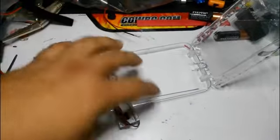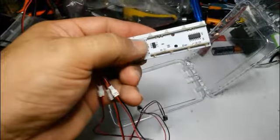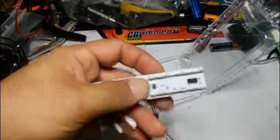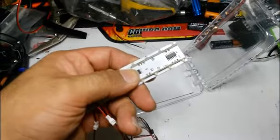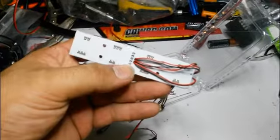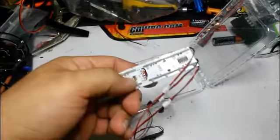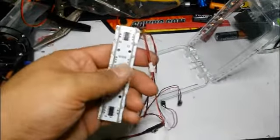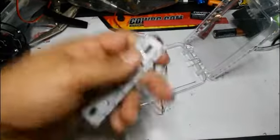You don't eventually end up breaking the soldering points, which aren't secured by anything — they're not secured. Some people will put a blob of some kind of sealant on there, not only for waterproofing but to keep those in place when you're working on it. Over time they come loose and then your product doesn't work anymore. So the first thing I'll do is blob that with maybe some Amazing Goop or Shoe Goo to secure those down. Overall it looks okay.